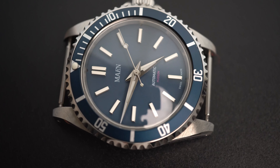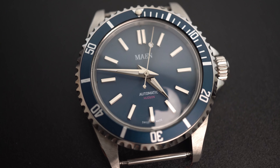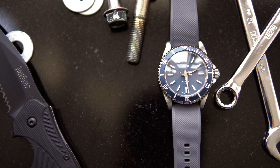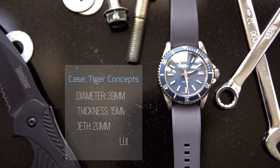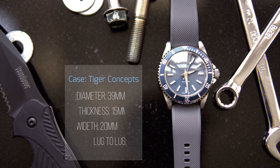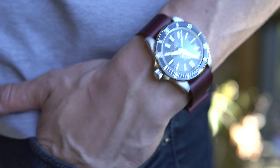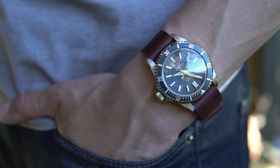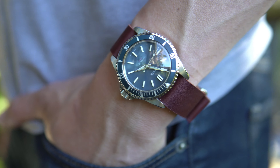The hour and minute hands are spares from a Seiko SARB035 that was cannibalized. Together they make up this blue diver that is part sporty and part dressy, almost like the new Blue Bay or a vintage Tudor. The dimensions remain manageable and much of the thickness comes from a highly domed acrylic crystal, giving off a nice off-angle distortion. The dial was too large for the case, requiring a bit of Dremel work. Its feet also needed to be removed and the dial taped to the movement spacer. Notice that the minute hand just barely clears the chapter ring.